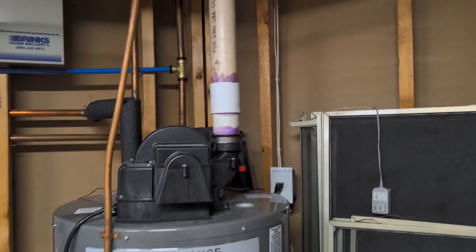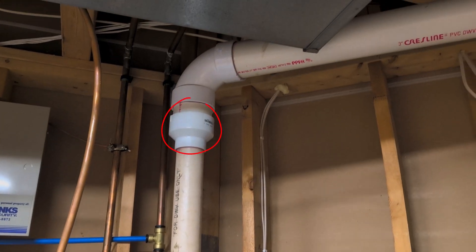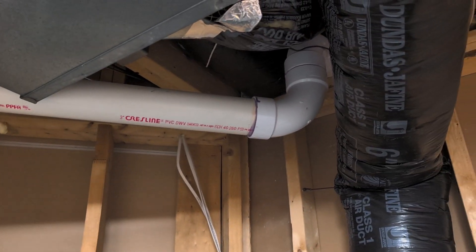Now, when you've got three-inch, you can almost do whatever you want. Here's an example — here's my water heater. If we look at it and follow it, it's got a two-inch pipe coming out from the manufacturer, but then we've got a transition fitting here and it changes over to three-inch. From there, it's three-inch all the way out the side of the house. Even though it starts with two-inch, this is a three-inch vent.